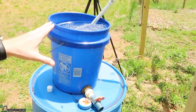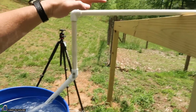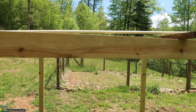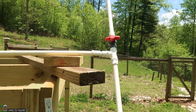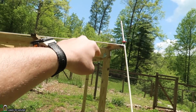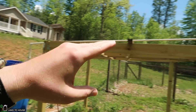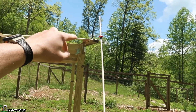Here's the setup over a makeshift dam. Of course we have our water source, which would be on the water side of the dam. The pipe just goes in a couple inches, comes up, and you'll notice that it goes over this board which is about six foot off the ground. It continually goes up until it reaches the highest point right here, and then it slides back down the drive pipe to the pump. This is not an ideal setup because there's a 90 here and then some other things going on. You'd want this to be as straight and as flat as possible — even using a Y connector up here instead of a 90.